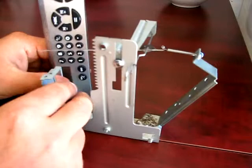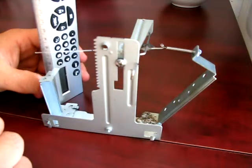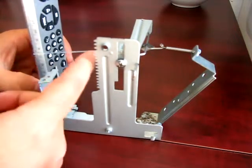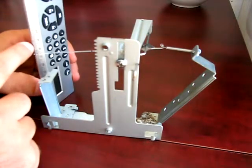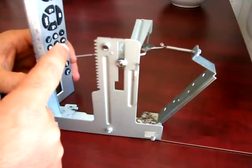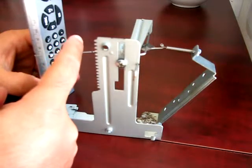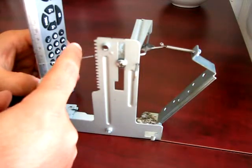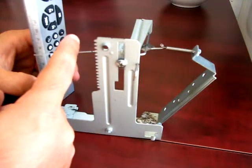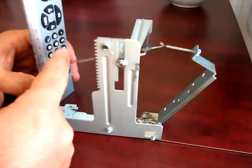The idea is to put a ruler somewhere close to the glass rod — this is a glass rod, by the way — and just to measure how much this thing is going down, how much the glass rod is going down. And if I do repeat movements, I can see that it's fairly reproducible. The rod comes back up at almost the same place, which means that there is no plasticity in the system. It behaves elastically.